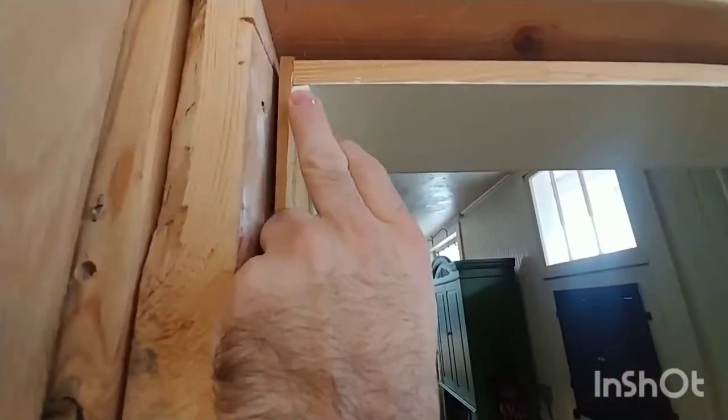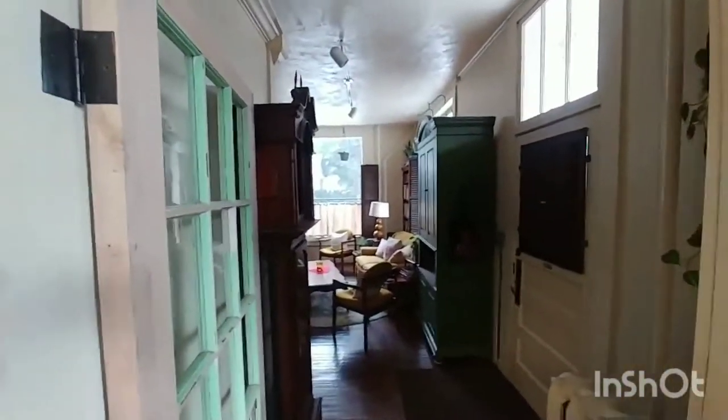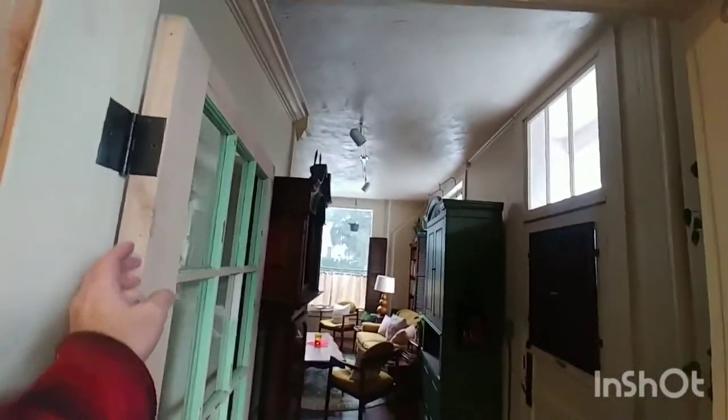just so you don't hear or feel that. And it wasn't as tall as it needed to be for this jamb that went in here. I think I've remade the top piece, but these two sides are rabbeted as if it was a commercially sold jamb. Anyway, it went in as three pieces. And it just was whatever it was at the time. And then the door was whatever it is. And frankly, it needs another 2 inches in height.